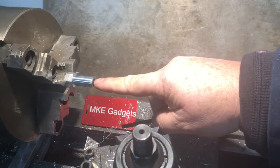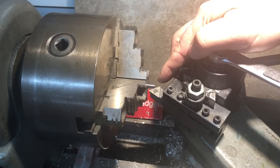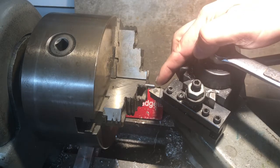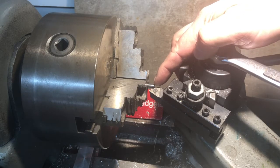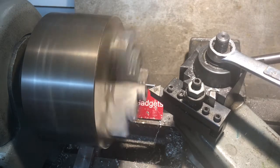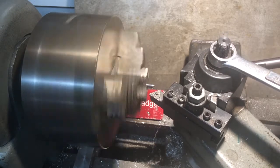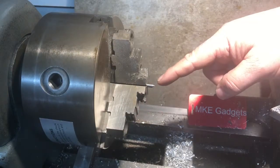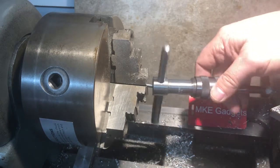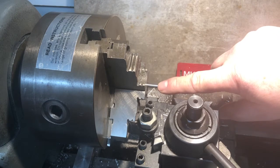A set screw sets in there. Let's move on to the next part. We have the 3/16 drill rod in the chuck and now I want to put a point on there. You don't want the stock sticking out too far because it will bend over and break, so just have it out far enough to get a nice point. The angle is not critical as long as the end of your tap handle fits in there. I'm going to put multiple grooves in, a quarter inch apart, so when I'm tapping I can tell how deep I'm going.